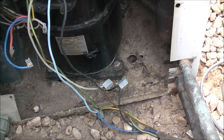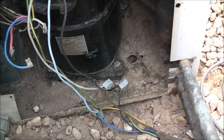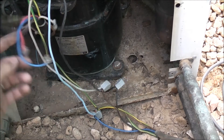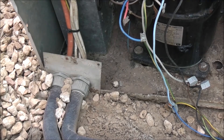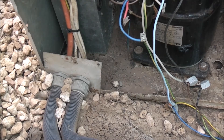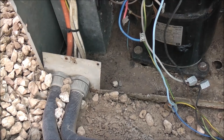It's got a cutout for the discharge. There's one valve here and one there to charge it with. That's a resetable one — manually resetable. That gets too hot and it's supposed to shut down. It goes to the compressor and into the controller box, so that goes to a contactor and turns it off. The compressor's not damaged. It's been disconnected for a while — the fuses in the meter box are disconnected, this is all not live. The neighbour said it's been about five or six years since they stopped using it.